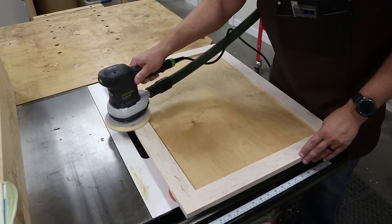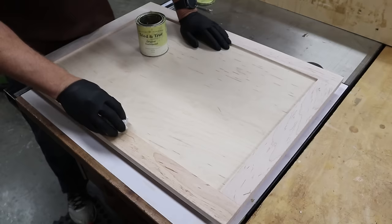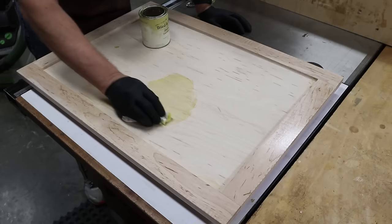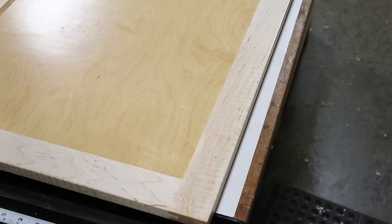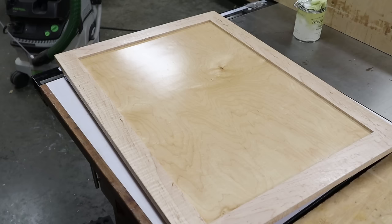Then I follow that up with 180 grit to make it smooth to the touch. To finish my door I'm using an oil-wax blend — I really love the silky smooth feel and easy maintenance of this finish. You may opt for something more durable like a lacquer or poly finish if your doors are going into a kitchen or another highly trafficked area, but for my shop I'll stick to the simple and fastest finish because I can repair it easily. Since the back of the panel isn't pre-finished, I go ahead and hit that with the wax too. I then applied the finish to the front side on the frame, staying away from the pre-finished panel in the middle. You can really see the figure pop out in that maple when the oil hits it. I allowed the finish to dry for about an hour before buffing it out with a clean rag until I got a nice luster and a buttery smooth feel.